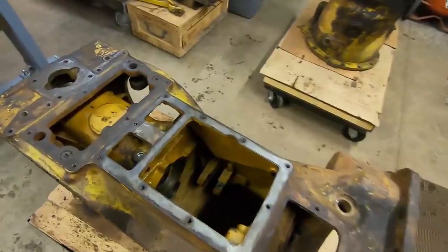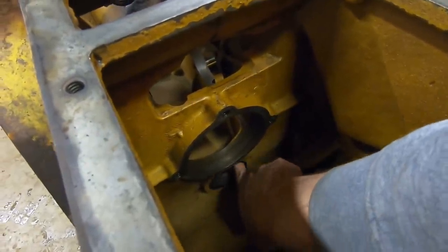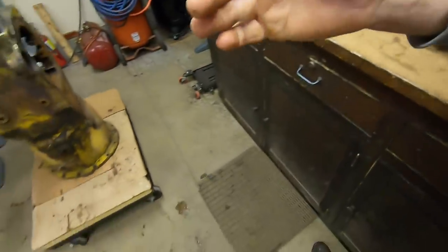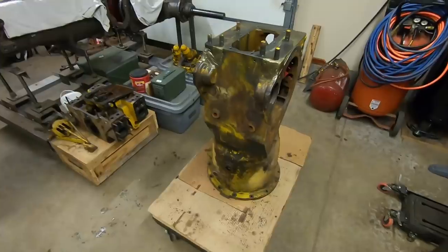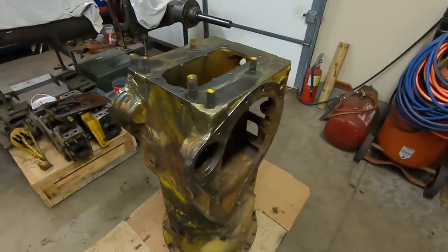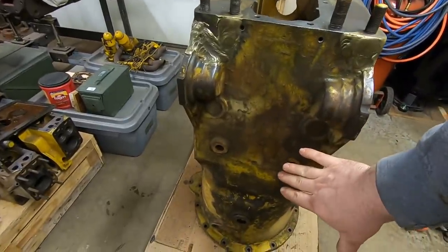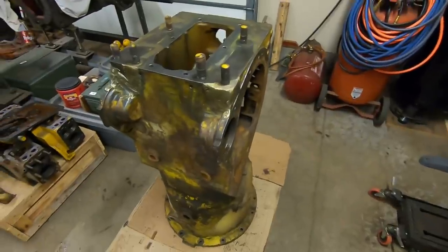So the first one I'm going to look at is this bearing race, pardon my shadow, way at the bottom, way down here. That's for the back bearing on the counter shaft. I'm not sure if I'm going to have to pull that out of 1113's case yet, but since I have old 2115's case just about finished in here, and it's kicked up anyway because we got to do part of that job from the bottom, we'll take that race out of this one, at least for demonstration purposes.